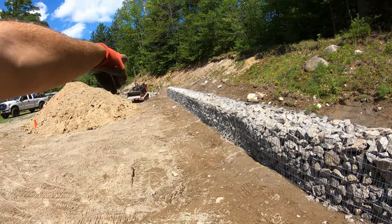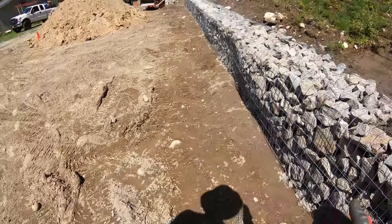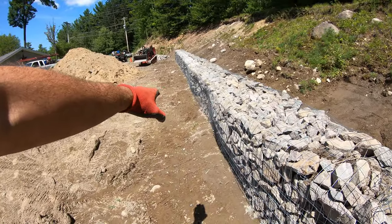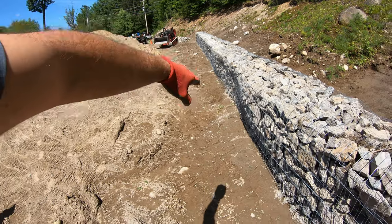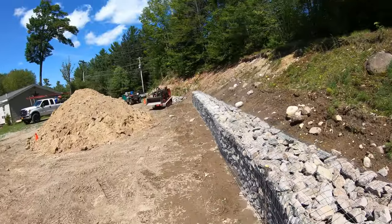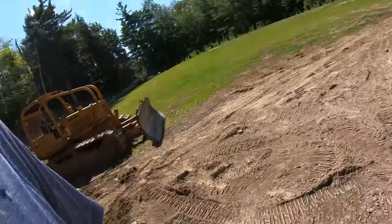But eventually, I got some leftover riprap over there. I think I'm going to have maybe a 12-inch or 18-inch drain here. As the water seeps through, it'll run down, with some fabric in there or some sort of moisture barrier, and then the riprap, so it'll fall into the tunnel like a swale and run down here. I think that'd be a really good idea, so the water doesn't just seep in under the building. So yeah, that's good for today.